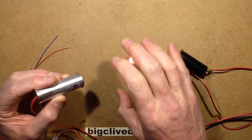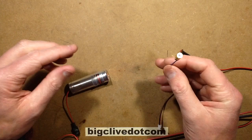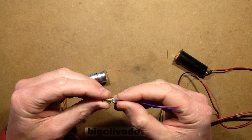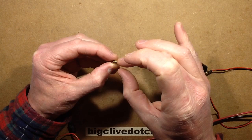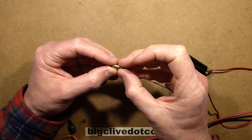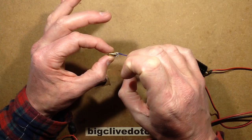Now of course lasers — you can buy two for a dollar, or for two dollars you get ten lasers, all-inclusive shipping. It's ridiculous. These little semiconductor lasers, particularly red ones — the drive circuitry is just a resistor to limit the current, then the laser diode is a lazing diode fabricated in the form of an LED, a lazing cavity with the mirror at one end and the semi-mirror at the other. It's pretty much just like a traditional laser except the light is generated in situ by solid-state means. It's just a very cheap way of making a laser.